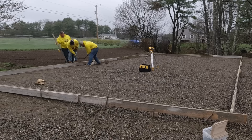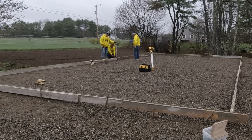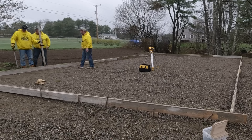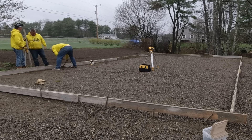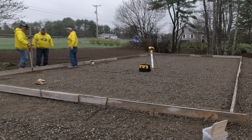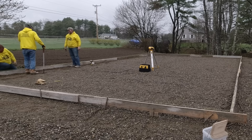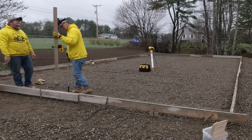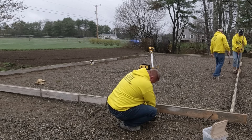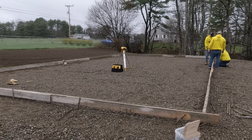This wasn't too bad actually. It was a little bit high over there where the guys are standing and just a little bit low in the front right corner — not much had to be done, it was actually pretty close. We've shown up to gravel pads that have been 6 inches off — you can kind of tell if you do it for a living when you drive in the driveway. We'll just basically turn around, go home and tell the guy: when you fix it and get it level, give us a call. But when something's only half an inch high or low, that's actually pretty good. One guy holding a grade stick with a laser, the other guy right behind him with a screw gun — things get set to grade pretty quick.